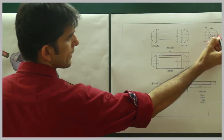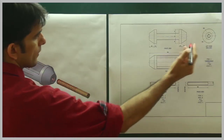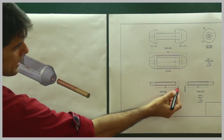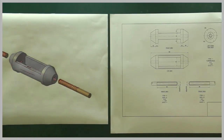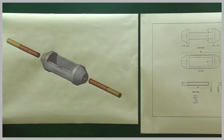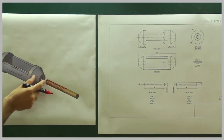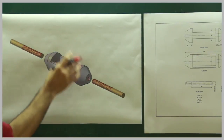You see this part, this part, this part — these three parts are important to draw this. Same on the other side. We have item 2 and item 3 — that is rod A and rod B. Both are threaded: one is M12 × 2P LH and the other is M12 × 2P RH — one is right hand thread and the other is left hand thread. M12 means diameter is 12, and 2P means pitch is 2mm. We need to insert rod B as well as rod A from both sides and only 50mm should be inside the turnbuckle. That is what assembly is all about.